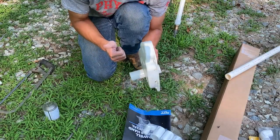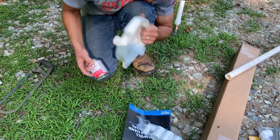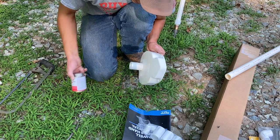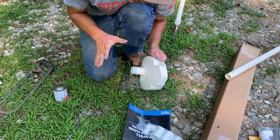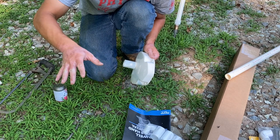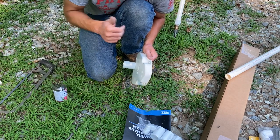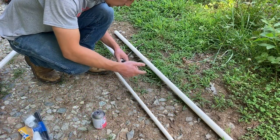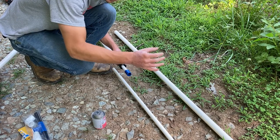We got the cap done. You've got to check your cement — mine is a 15-minute cure until full application — so they recommend getting this done early and having it ready to go when you go to install. The next step is really just getting all your pipe laid out and connecting it all. We want to glue the half-inch piece first, then glue our one-inch piece, and just repeat that process.